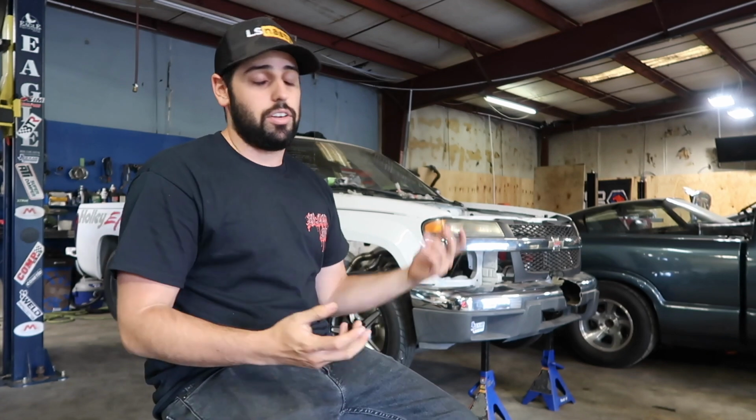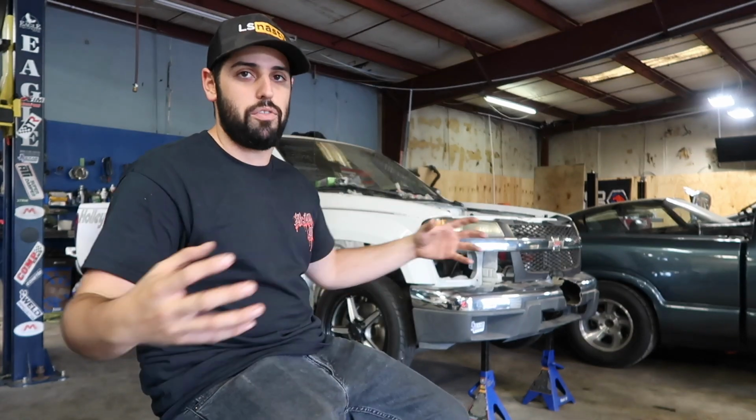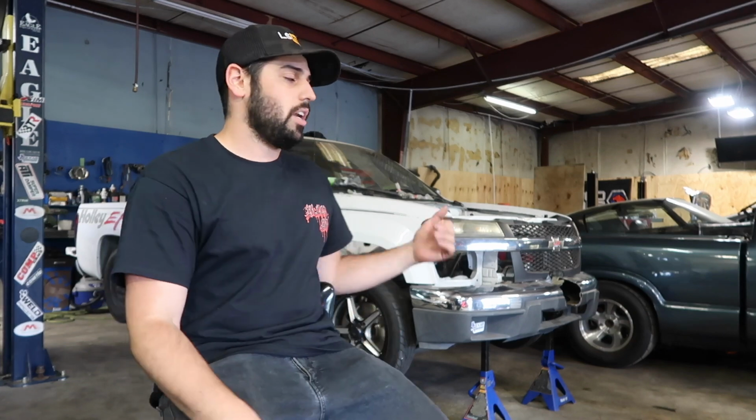Right now it's just a stock bottom end 6 liter. It's got a blower or NA cam that was dinged up pretty good. It's got rocker arms with a trunnion upgrade, 7400 pushrods, stock LS7 style lifters. Everything in there is really used. For those of you doing the swap on the Colorados, it's got an H3 oil pan, and we used Current Performance. They did the motor mounts for it. So it is on motor mounts, even though it's got a fake motor plate for the blower to attach to. That's how we got it set up.